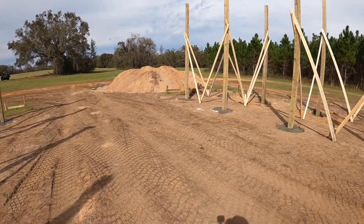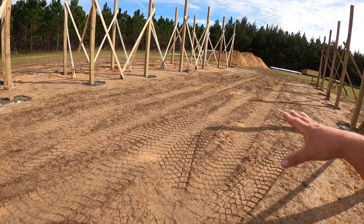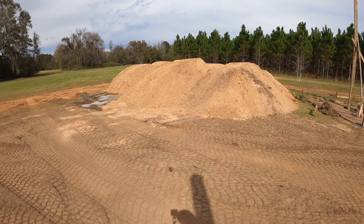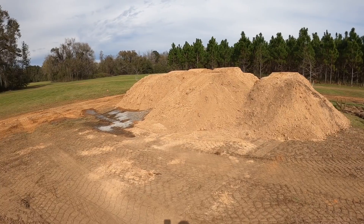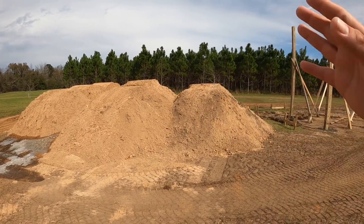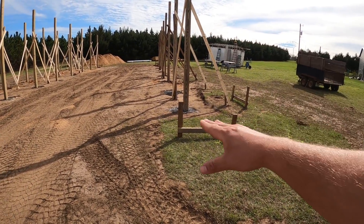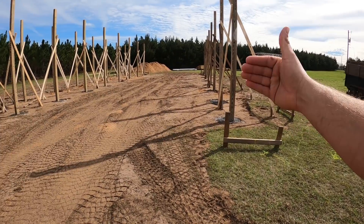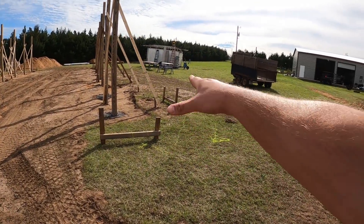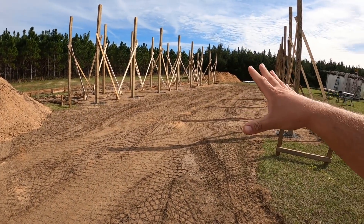So really the concrete could have gone higher, but it would have just poured out everywhere. A tremendous amount of fill dirt — I went ahead and bought several extra dump truck loads. We originally called for six, but once we scraped so much topsoil out I went a little deep, so I told them to bring me 10 truck loads so I can make sure I'm not short. Because the end of the porch is so high down here, I'm not doing a stem wall, so I have to flare dirt all the way out here and around the corner.